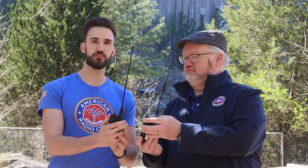The Baofeng makes it really easy. It's not that much harder on the Kenwood. All you need to do once you're in VFO mode is press the enter button, and then 1, 4, 6, 4, 3, 0. The radio knows where to put the decimal point, so you don't have to worry about that part. And if you've done this correctly, you should see that both radios have the same frequency listed on the front. This is simplex, so remember we're just transmitting and receiving on the same frequency. The radios are speaking the same language so they can talk to each other.